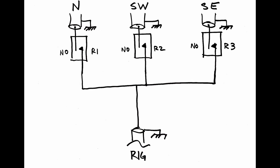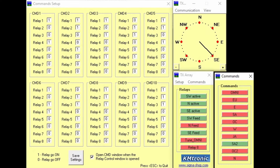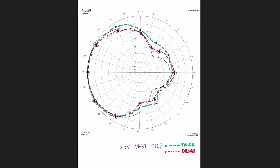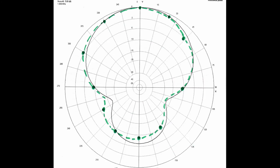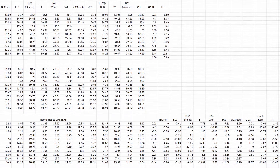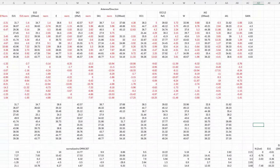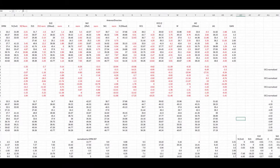This may sound like a complicated thing to implement and switch, but stay with me — I'm going to show you how it's really easy to do using a few tricks. Here's how the field measured azimuth patterns compare to the model. The fat hand-drawn lines are from the measured field data. This plots an average from all six of the measurements I made from the truck — sure looks like a close match to me. These values are plotted by normalizing each station stop to the omni direction for that same station stop, so the values are corrected for distance amplitude variations.